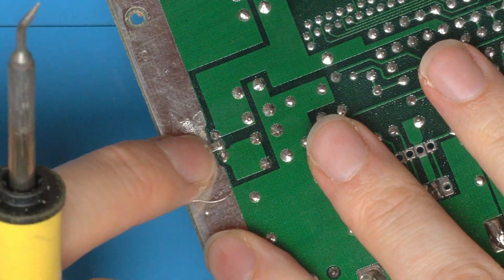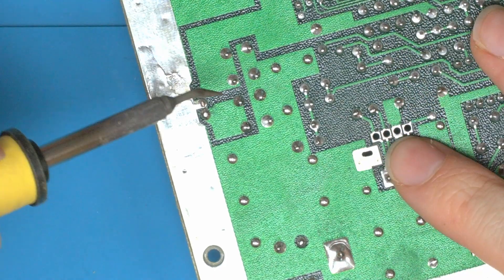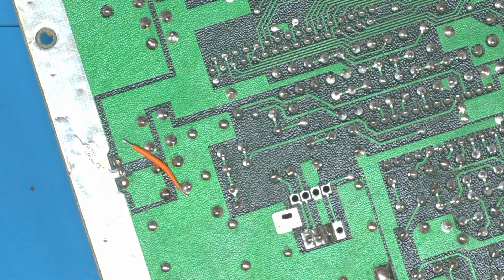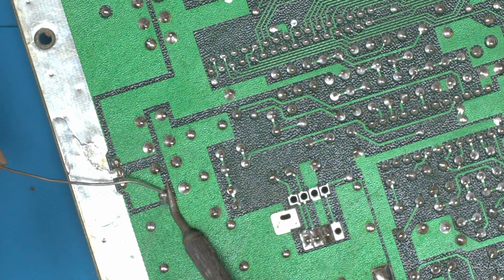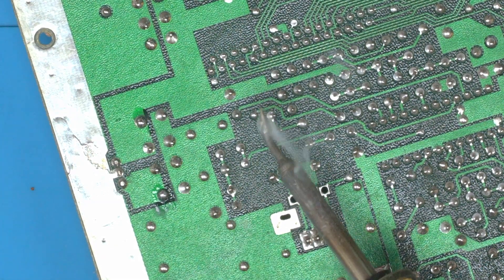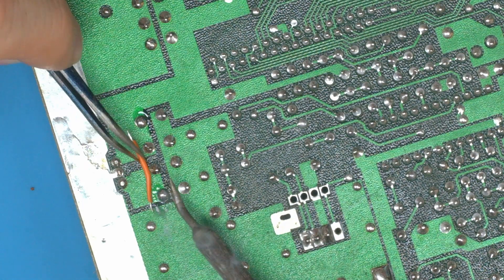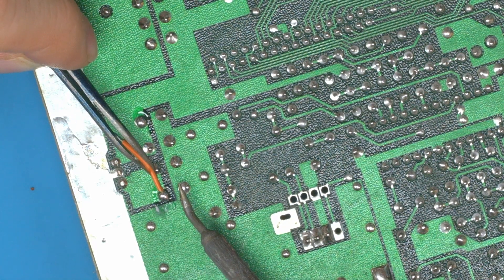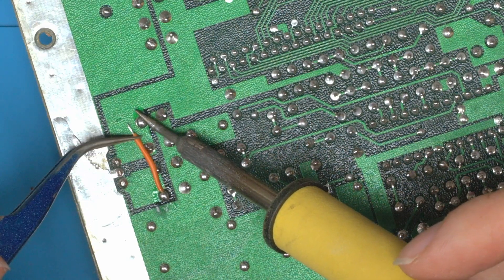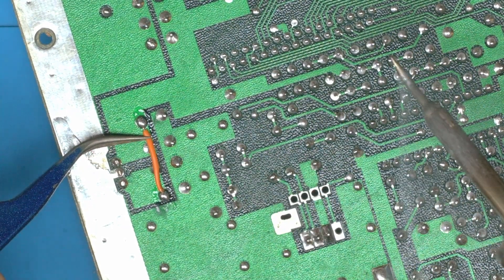On the back of the board, you'll see where the regulator connects. We want to bridge the input and output — you can bridge over here or over these two pins; it doesn't really matter which, so long as you do one of them. For that, we use the included little bit of orange wire. Just make sure once you've done this, you never apply nine volts to the system — always use the USB-C, or remove this wire, because this bypasses the regulator altogether and we're simply sending five volts straight into the system. There's no need for a nine-volt regulator.